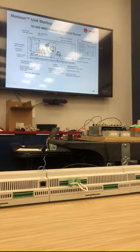Find the sweet spot with the sensor, with multiple positioning. They also need to put a turn, a 90, and put vanes in that thing. Yes, vanes in it would be helpful also. I've had a couple that don't have vanes in there, and it's all over the freeway. And I think we tried an averaging sensor across it before, but I don't think that worked as well, because there's only so many points that averaging sensor picks up. Honestly, just getting enough turbulence down the ductwork and getting a sensor farther away is the best.